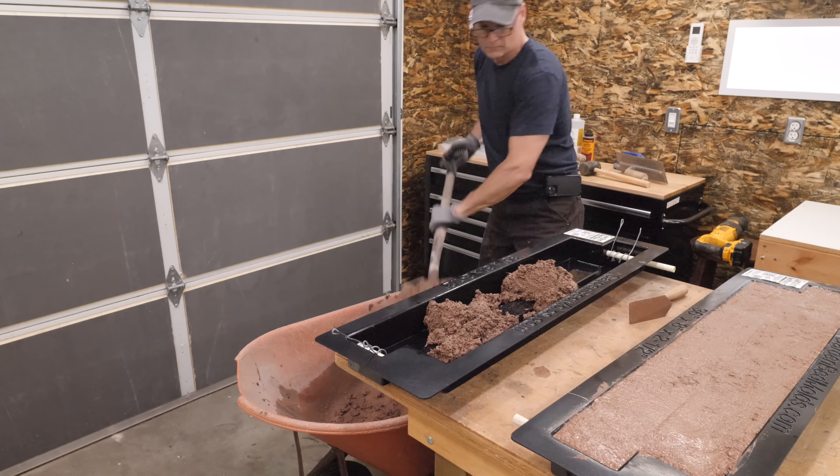I made up another batch of the perlite mix and filled some 24-inch molds. When done, I cover all the fresh lightweight concrete with plastic and set the thermostat of my shop to 70 degrees. After 6 hours, the concrete has solidified and I can remove the pipes that form the holes in the castings. I use a small nail to pull and rotate the pipe. The pipes are easiest to remove when the concrete is still a bit wet but solid. The time to solidify depends on the amount of water in the mix and the ambient temperature — for this mix it works well to pull the pipes after 6 hours, which will take longer in a cooler environment. Waiting longer will also make removal more difficult, and sometimes you may have to gently tap the pipe with a rubber mallet to free it.